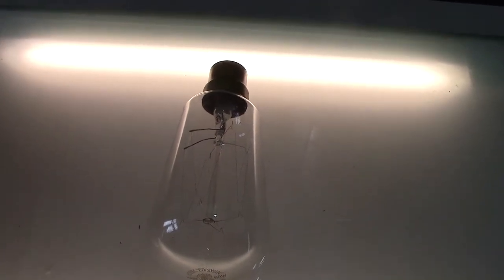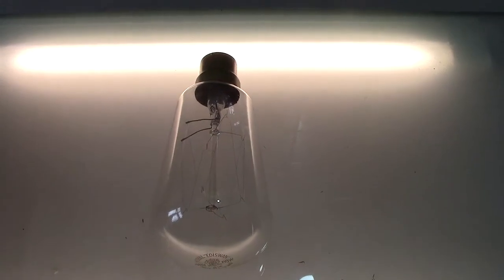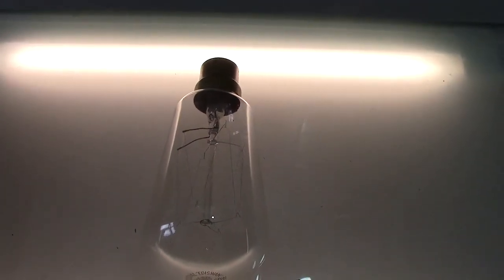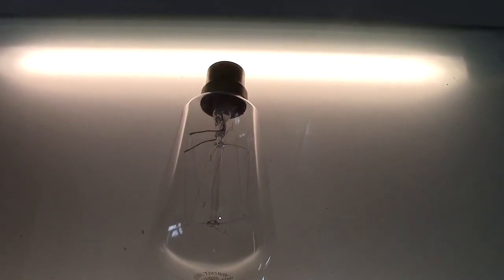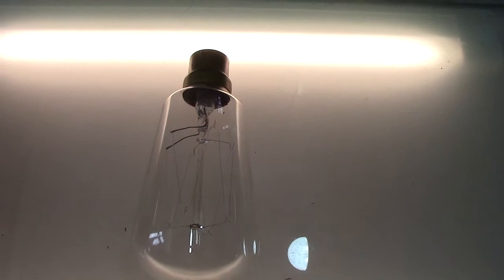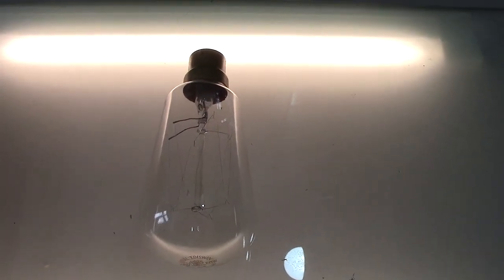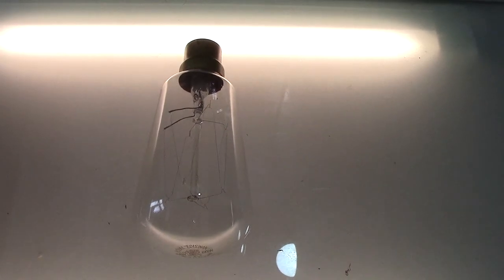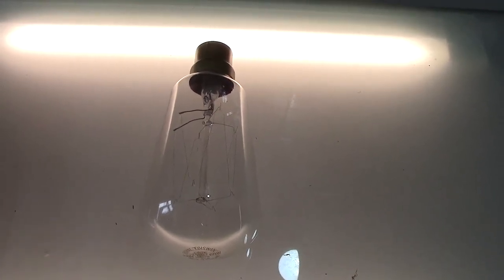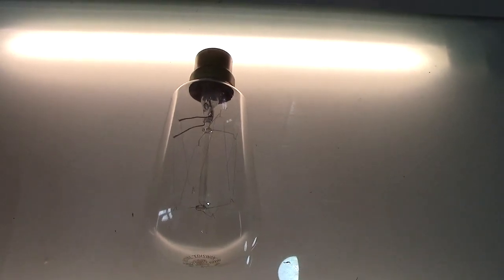Well, obviously it's very rare that you would get a fault on it, very rare. And I can tell you now, this is not the one from there, but I had to check the lamps within these lanterns, and in one of the exchanges I was at, which was quite an old exchange, when I opened it up, lo and behold, we had one of these. And I thought, oh well, that's due to need changing because it's been up there for donkey's years. So I swapped it for a normal modern day 50 volt lamp, which they had plenty of, but not plenty of these. So I won one of these lamps, the same size, squirrel cage, 50 volt, and I was well pleased.